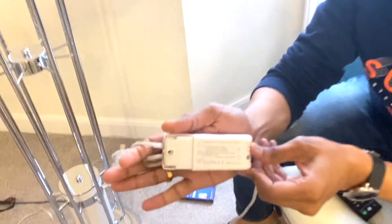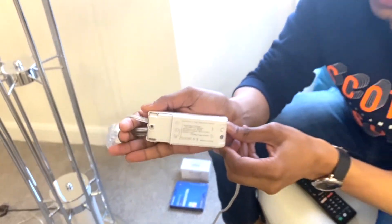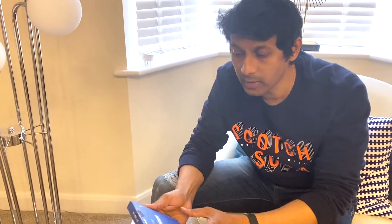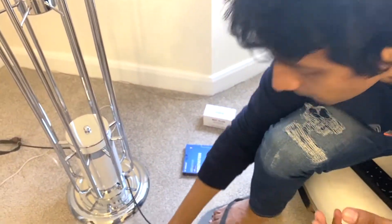For this project I have a WiFi dimmer. It is hard to get a WiFi dimmer that is LED compatible at the market. The usual dimmers do work, but the problem is that even when you turn off the plug or tell the dimmer to turn off, the lights simply don't turn off — they will still be glowing at 10 or 20 percent brightness. Make sure you buy dimmable LED bulbs, as regular LED bulbs don't work with this. I'll leave a link below for the dimmable LEDs and the WiFi dimmer.